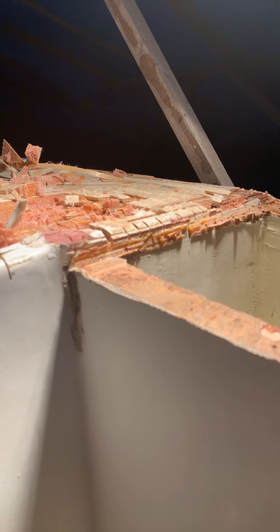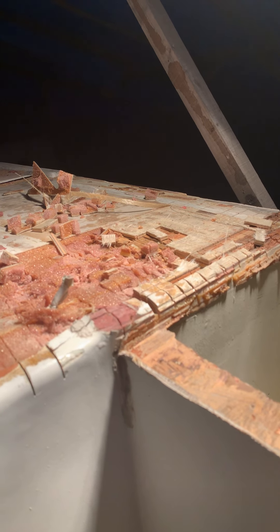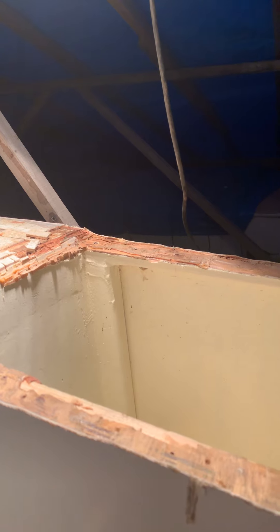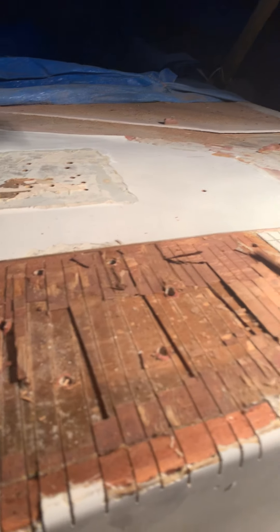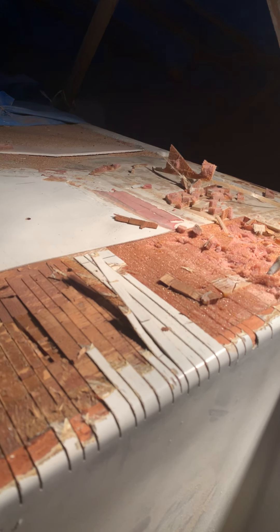You can see there was a step here where the deck transitioned from a half-cord, half-plywood infill deck section that met an area back here at the general winch area — a doubled layer of plywood with a net thickness of an inch, two 12-millimeter layers that were just really badly laminated together. I had a quarter-inch gap on one side when I took it out.